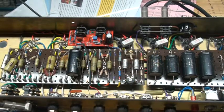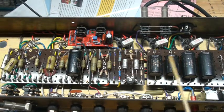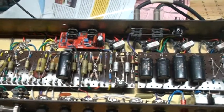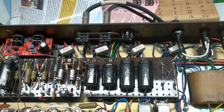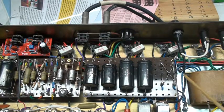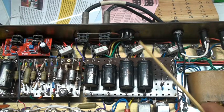For the power section I have a 33µF capacitor with two sections, and then these are 100µF capacitors. The diodes here are the 1N4007, which I believe are rated at 800 or 900 volts. My screen resistors are 1K 5-watt — I can't remember the brand, I probably said it in the first video, I apologize.